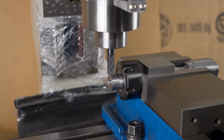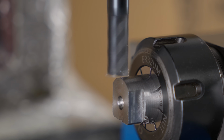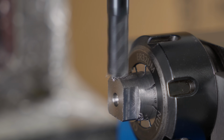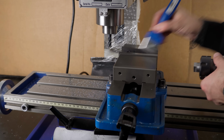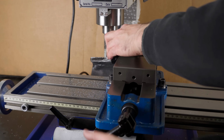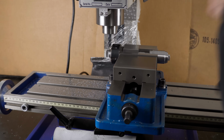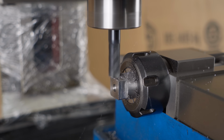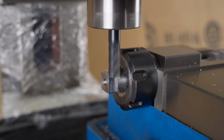I haven't figured out how to drive it yet, but the carburetor body is already an imbalanced mess. So adding a lathe dog in the mix is something I'd like to avoid. Plus, I have lots of these carburetors, and from time to time, I also get requests to rebuild them. So perhaps it might be worth it to invest some time and make a proper driver. It's not only about the time it will save me later down the road, it's also about the accuracy, if this proves to be repeatable.